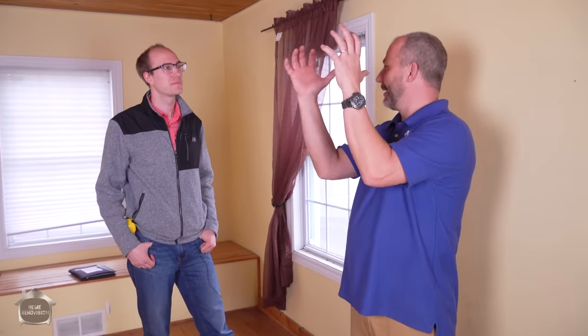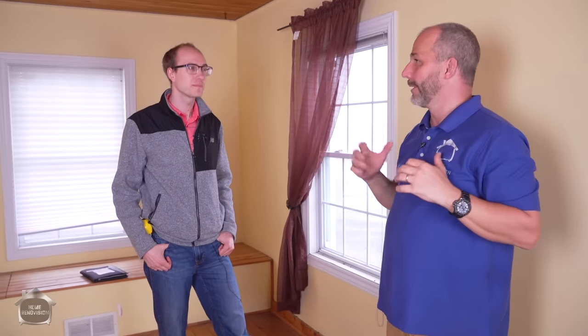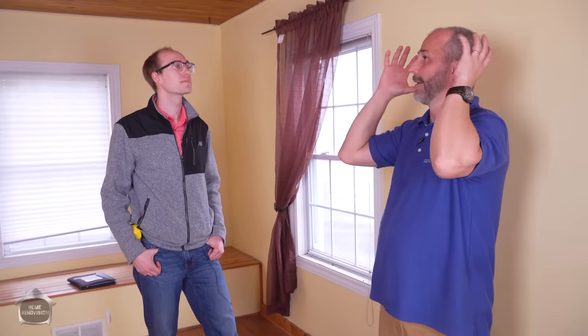So for my design, I'm going to think I'm going to clad the beam itself anyway so I can cover all of the joist hangers. When I'm finished, I'm going to have a painted ceiling and then an exposed raw finished beam — takes a little extra work, but I think it's going to look good and better safe than sorry. Let's go talk about the other beam because it's totally different — this one is going to be carrying load.